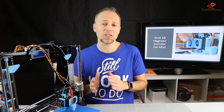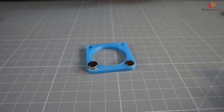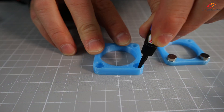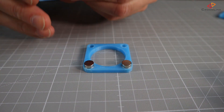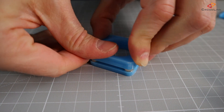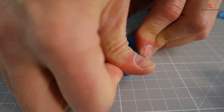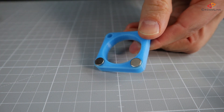Now we need to check that the orientation of the magnets for the second part is correct. The easiest way to do this is to take two magnets and let them fall onto the first part's magnets — they are so strong they will self-orient correctly. Now put superglue into the cavities of the second part and press the second part down onto the magnets on the first part to get them into the cavities. This can be a little bit harder, but that's actually good because the magnets are really strong and otherwise might come out of their place.